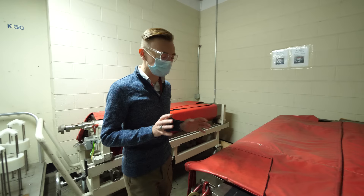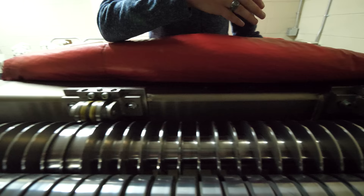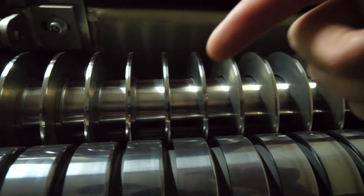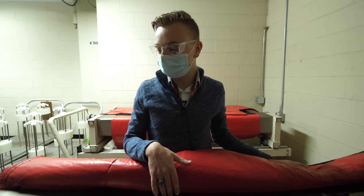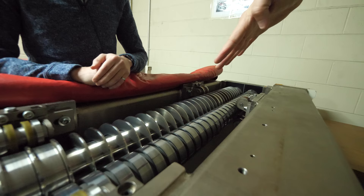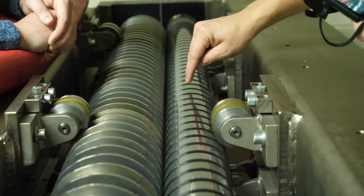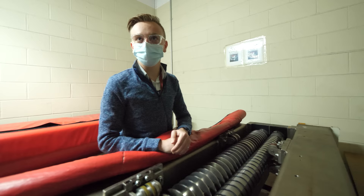Patrick walked me to where they had a huge assembly of slitting machine blades. We've got an upper and lower set in this frame. These are the knife blades — a right-angle edge. There's some geometry science to it, and it shears right here. So this is a shear cutter where the film runs straight through. They use two different processes in this building: shears straight-through slitting, and another where the film actually wraps around the lower roller, making contact with a sharp edge on it — about 100 degrees of contact before it comes out.